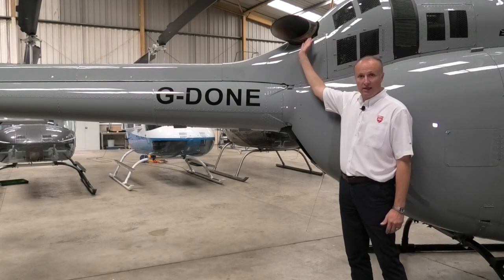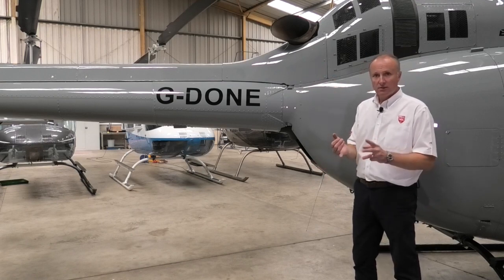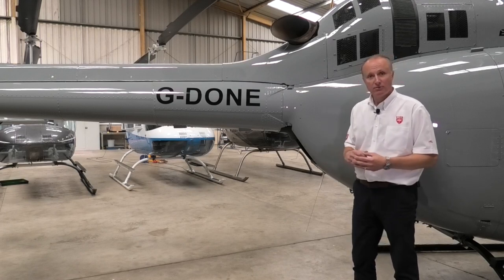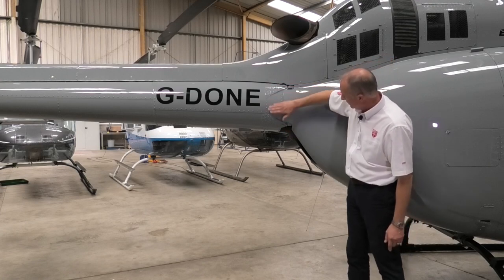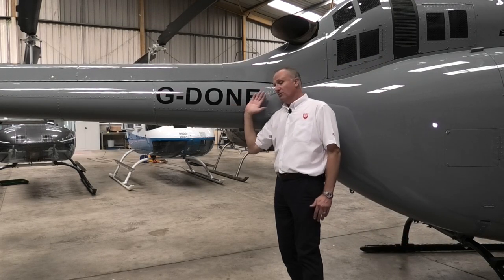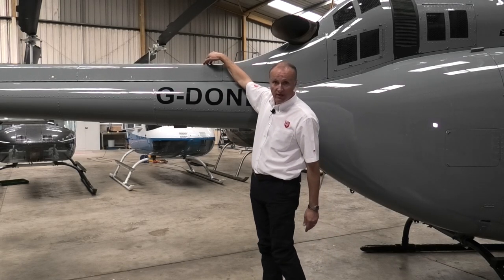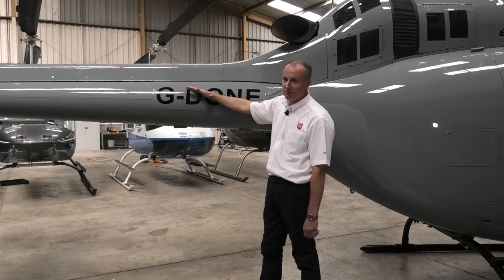Next item to check is the exhaust can. You want to have a good look down there — if you haven't had your covers on and you've been outside, for instance, you can have a good look at the turbine as shown in the inset, and also check that there's nothing in there, as birds do like to nest in the most bizarre places. We then check the mounting points for the tail boom and the doublers for any cracks or delamination. We look down the skin of the tail boom — the side skin and also the rear of the skin. We check the tail rotor drive shaft cover and its securing points, which all point the same way, making checking them for security really easy.